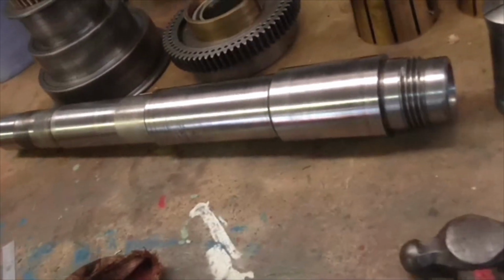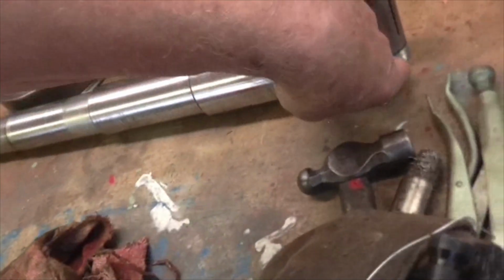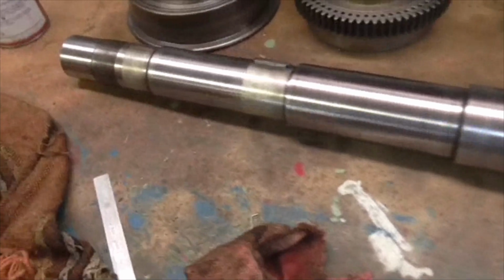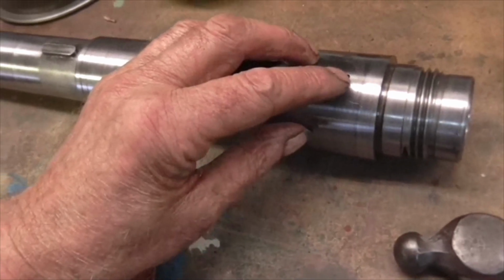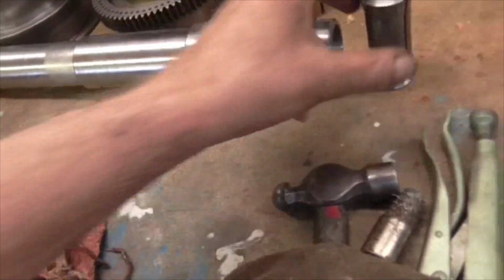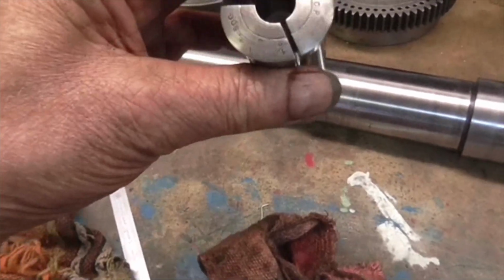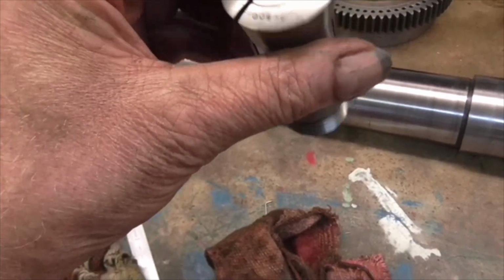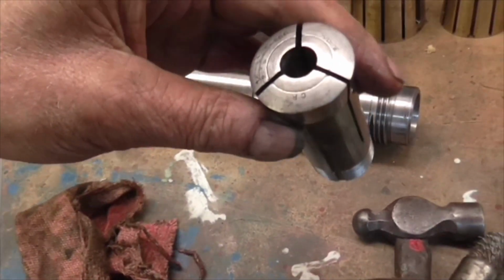to get those clean. I've had the flue brush on the end of the drill through it, and that's certainly cleaned it a lot. Also, I've done the same thing to clean the inside of this. Now this one's flushing through, but it is very much cleaner than it was. I've got all the swarf out of it. Like John, I have had to give my pin a tap down as well, and it now fits the collets. And here's a collet, right, that fits the nose. It's a Hardinge CR 500 half inch, 0.5 half inch. So there you go.